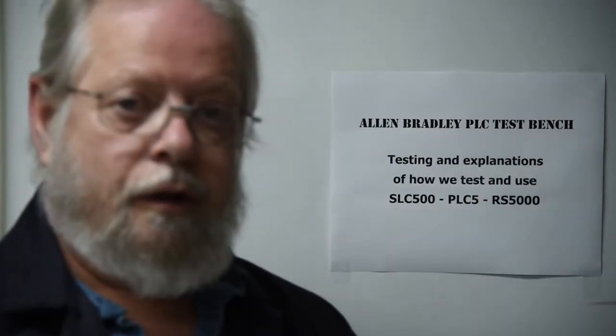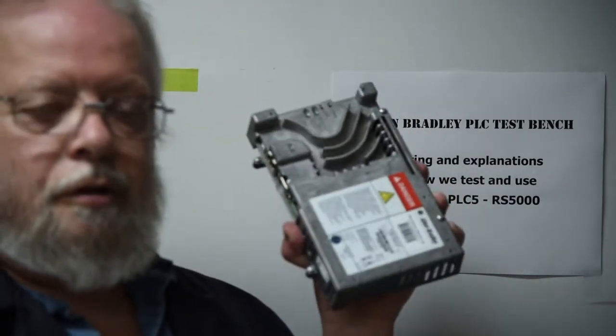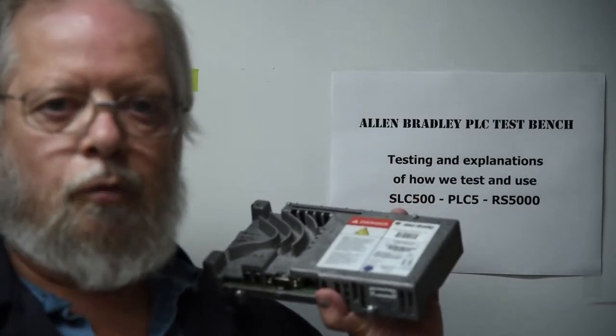But it's not. You're using the wrong module on the newer PanelView Plus screen. You need to use the RP-8 screen module for that screen. I'm going to swing things around here and set up and we'll step through it.